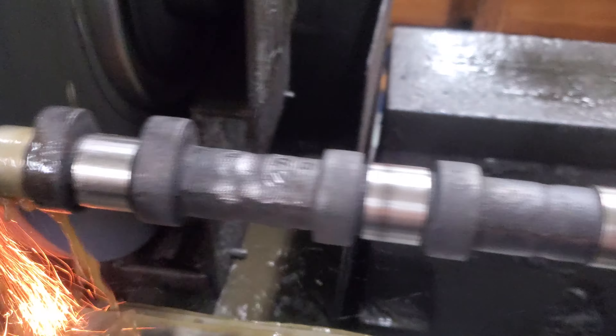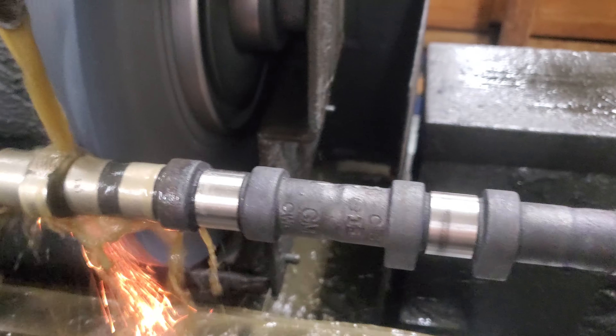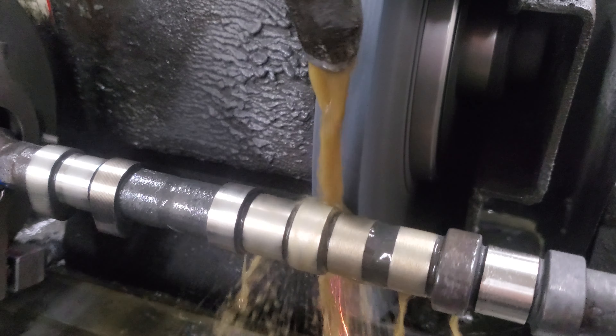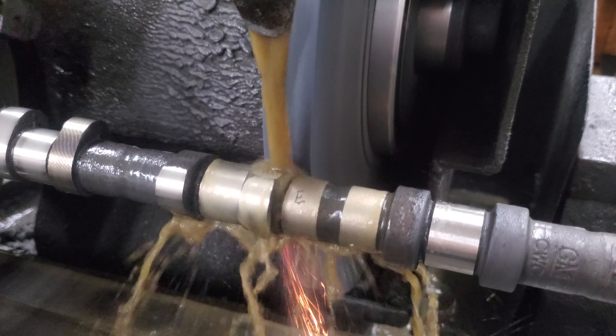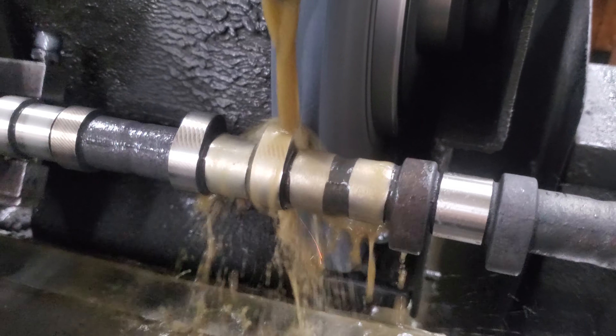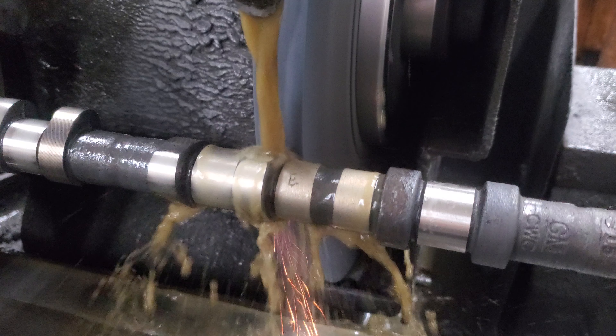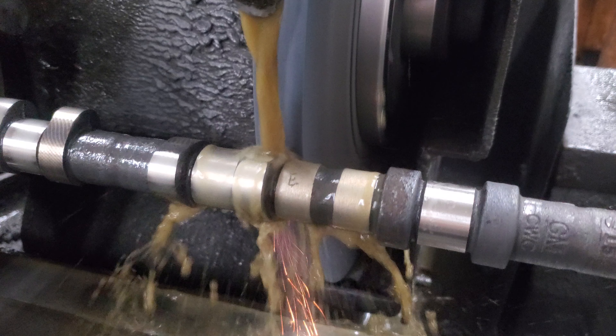See how these two lobes differ — number one lobe is already finished, number two is semi-finished. Number three and four, the casting is off a little bit, but it's not that big of a deal because these lobes are still about eighty thousandths oversize once they're done with this rough cut.